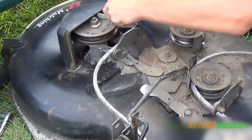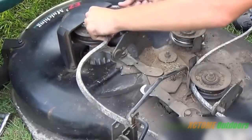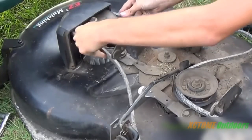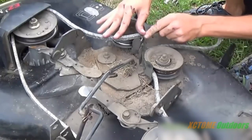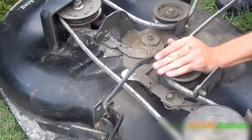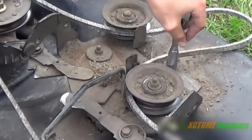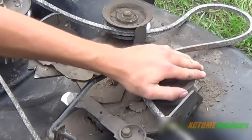Now I'm in front of the deck — you can see me. I'm getting this belt just like that. You're not going to tear the belt up; these belts don't tear up that easily. I'm going to pull this brake off and have it engaged for the time being, then pull this handle. It's in between the band. I'm going to disengage it so I don't get mixed up. Now you just wrap the belt and clip it through this guide — and voilà. That's how it's supposed to go: you engage it, it pulls back and tightens. This is not supposed to go this far though — there used to be a stopper right about where my wrench was, behind this pulley.